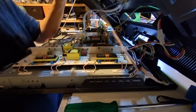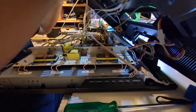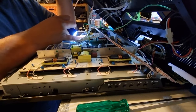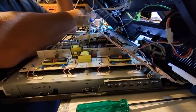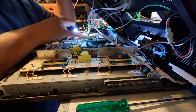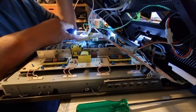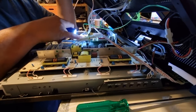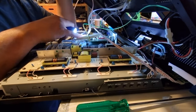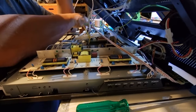And I did a bit of double checking, just because, you know, I have a habit of making mistakes like every other human. So these two guys here actually weren't mislabeled. I had that plug over here. So the DVD power port is actually this one. And I can see here, when it correlates to the board, you've got a ground, you've got a 12 volt, you've got a 5 volt, a 3.3, all those ones you need. That would have been pretty catastrophic to get that over there.